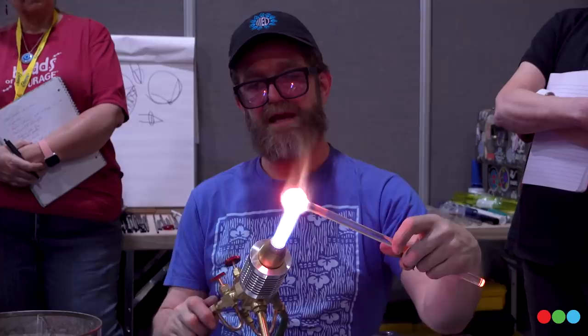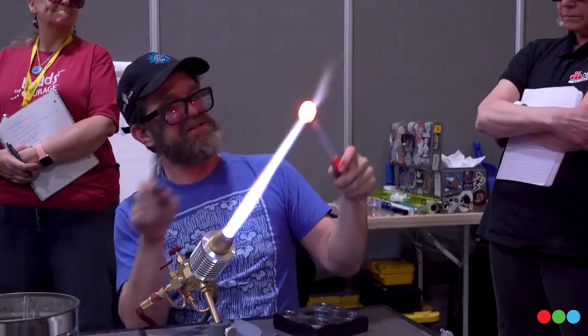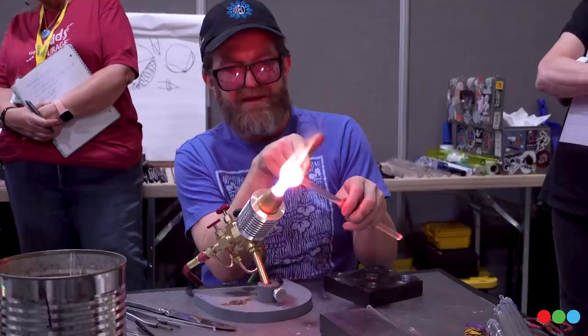Time to just do our shaping on this. We're going to focus the heat on the back. You can see there's a small seam at the equator — I want to make sure I'm getting heat into the low point there, but protecting the area where the marble and the rod meet, because that's my point of support.